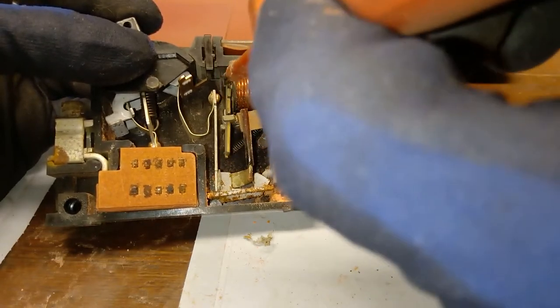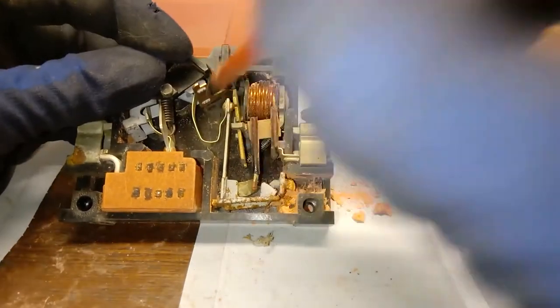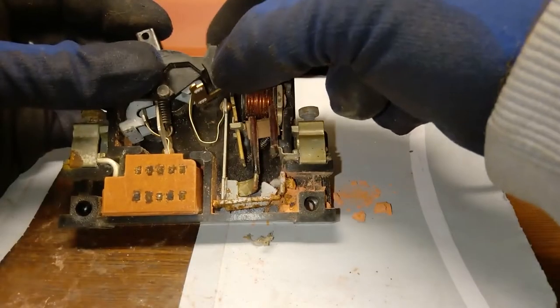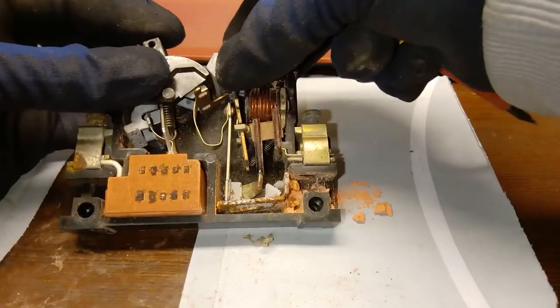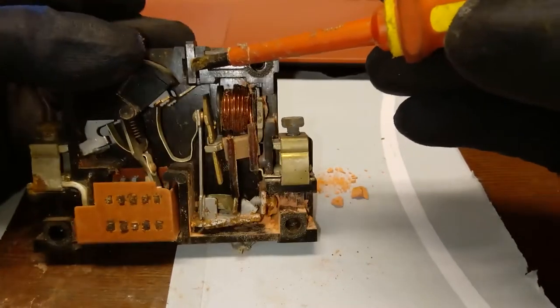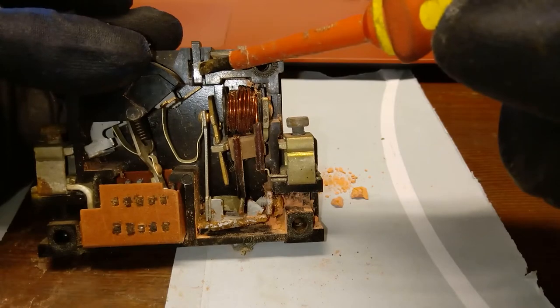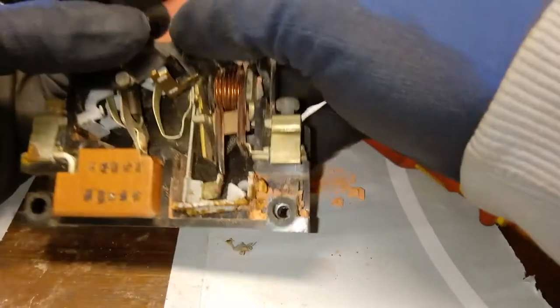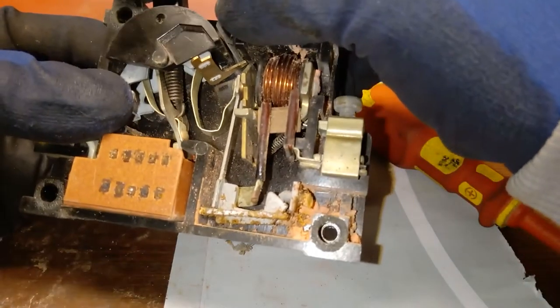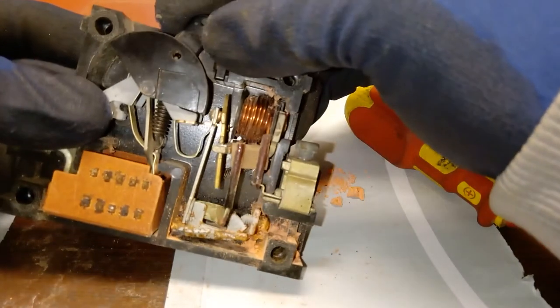This is just a balanced piece of metal that is holding in place. You can see this piece has pushed forward, and if everything is correctly aligned, this plastic piece — you can see it's now protruding outwards — that is your indicator that the device was tripped by a malfunction. To reset it, you push it all the way down, re-hooking that piece of metal, and the switch is re-engaged.